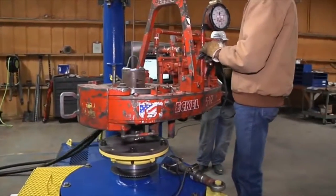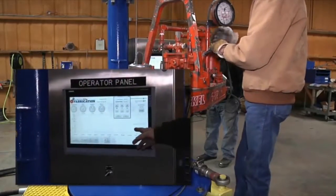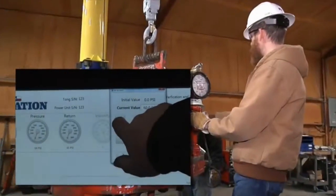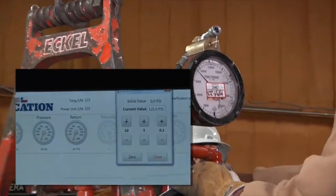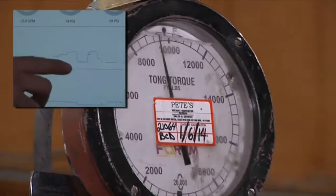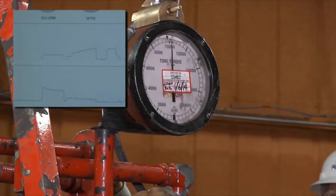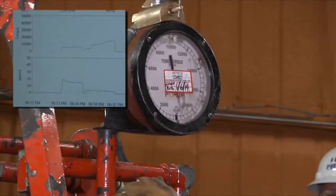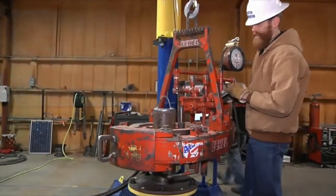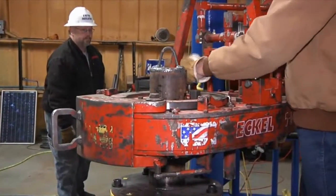At this point, we're going to get ready to start simulating torque. Turn on your control panel, supplying air to the brakes. Torque is increasing. Foot-pounds. Ease into your lever deadhead until you reach your achieved torque. Put your make-break pin back to make.